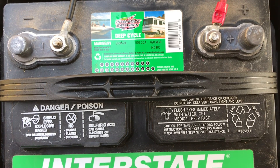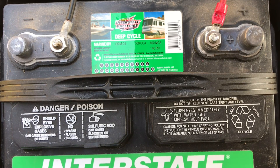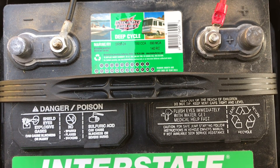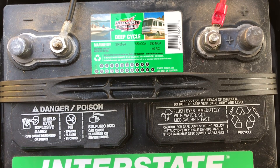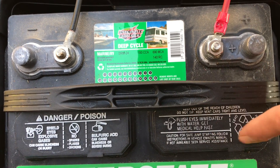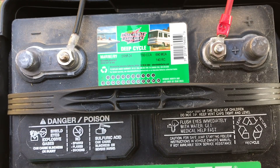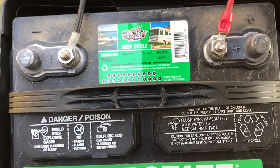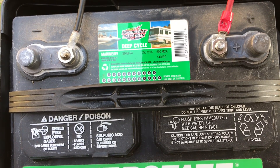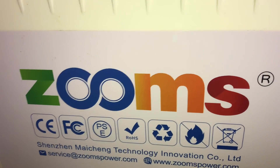You'll have to double or triple the size of your battery bank compared to lithium with lead batteries, but there's nothing to fail on them short of putting a wrench across them and shorting them out, or puncturing them to let the electrolyte leak. With a flooded battery like this one, if you're using it daily you'll also need to check the electrolyte levels and specific gravities. That said, let's talk about lithium iron phosphate batteries.